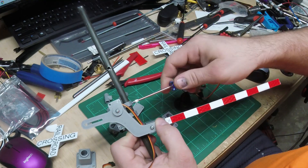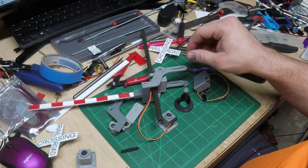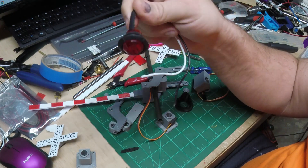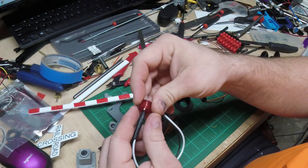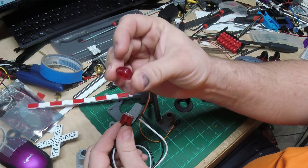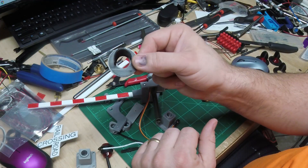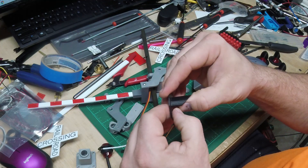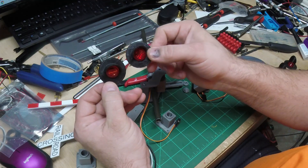For the lights I needed a red-amber lens, and my dad mentioned he had a bunch of little trailer marker LEDs — the kind you use on semi-trailers where you drill a three-quarter-inch hole and pop one in. This red-amber LED was perfect for what I needed. I took a saw and cut around the top of the lens to pop it off, then 3D printed the shades you'd normally see at a crossing. These pop in and once glued together they'll have that nice crossing gate look, with an alternating blinking LED in each one.